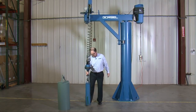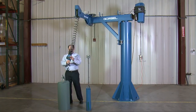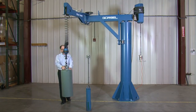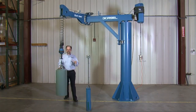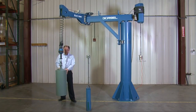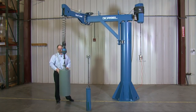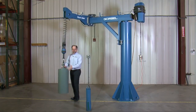Next I'm going to show you lifting up closer to a 500-pound load. You'll notice when I lift this load weight and move it around, I have to move a little bit slower. The arm still moves extremely easy — the ergonomics of the arm maintains that benefit — but with 500 pounds, you have to start and stop a little more gradually because the load weight is kind of the limiting factor to how fast you can move. But you can see that with relative fingertip force, I can still move this around, and the arm really does move very ergonomically.